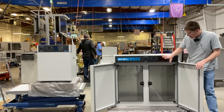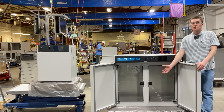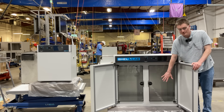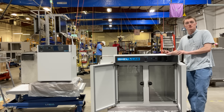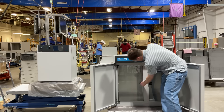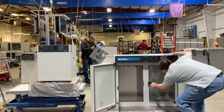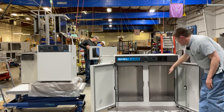Both feature glass viewing windows. These allow you to monitor the inside of the chamber without actually opening it up. Additionally, the outer doors are heated. This prevents condensation on the viewing window. These products feature a double gasket design to help improve temperature stability and uniformity. Located within the chamber is an accessory power outlet. This allows you to power any devices inside the chamber that you want to have. Additionally, there is a one and a quarter inch access port on the right side.